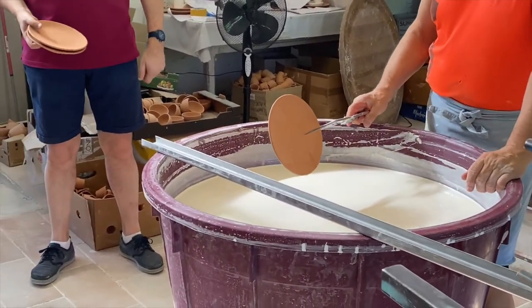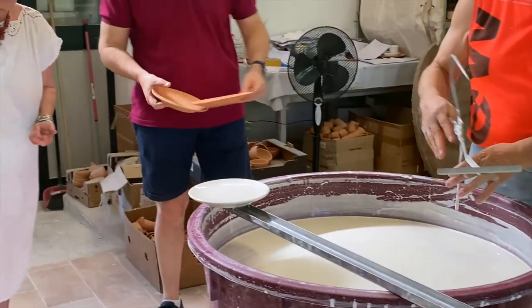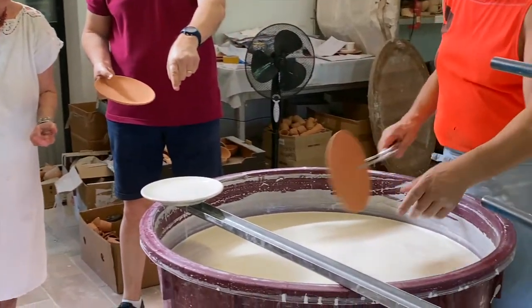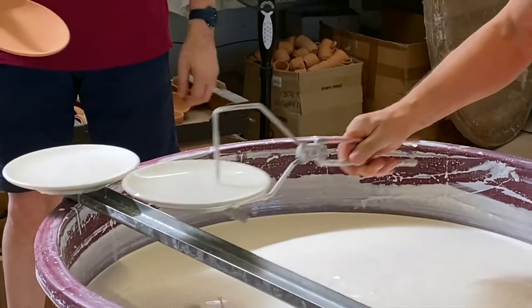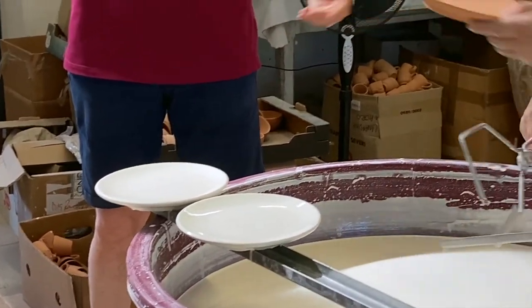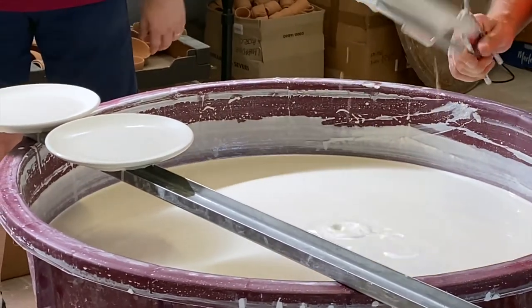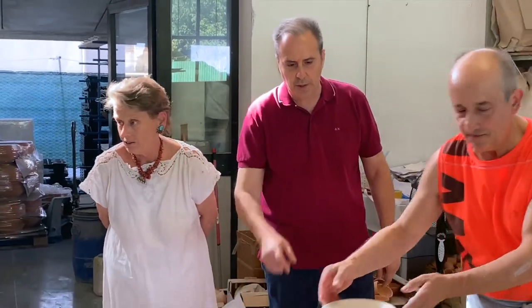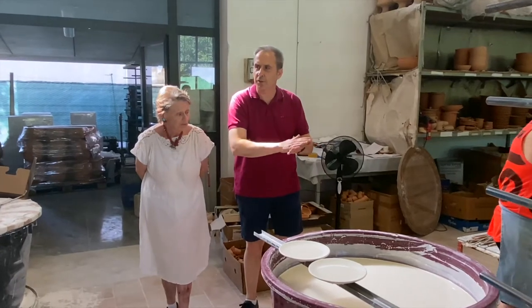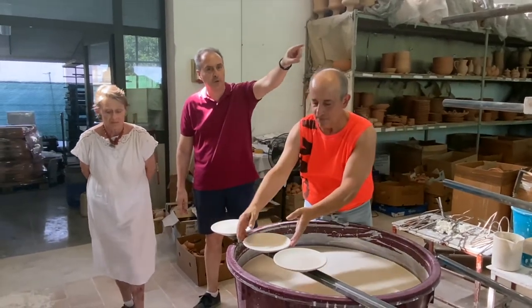You will see that the drying is very fast because the pieces are porous — they absorb the glaze — and in a few seconds we can touch and move them. This glaze is declared very safe by the European Community; it uses minerals and water, natural, with obviously no lead at all. Now we need to clean the bottom part to avoid sticking during the second and final firing. Now we have the base ready for painting.